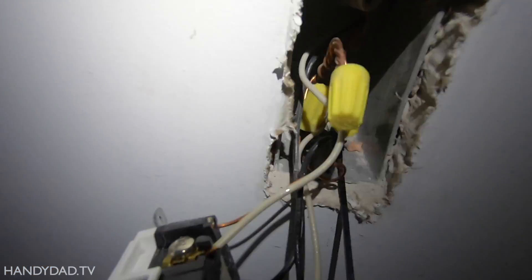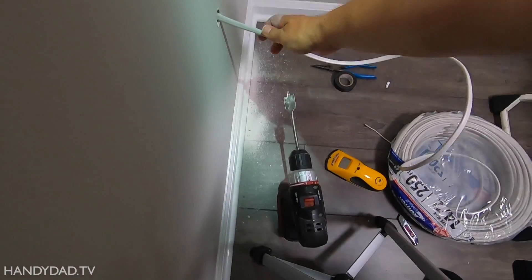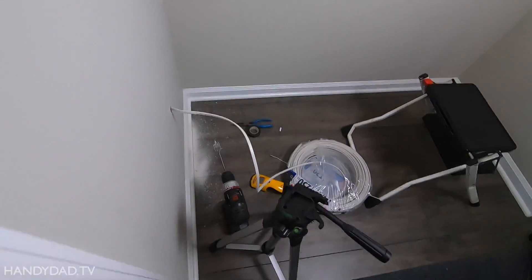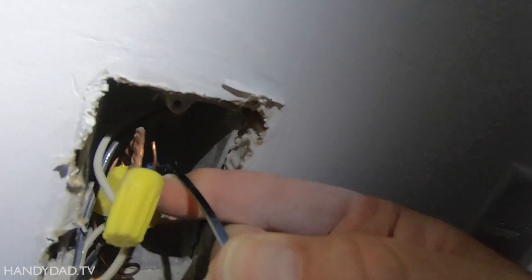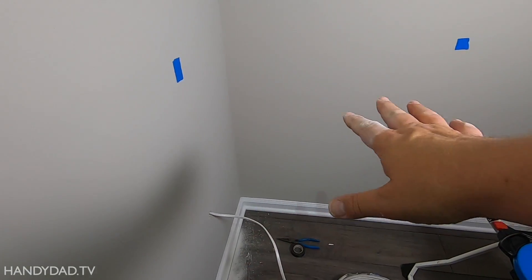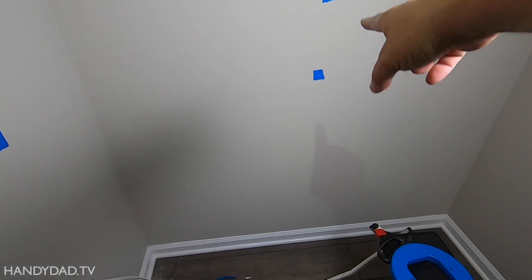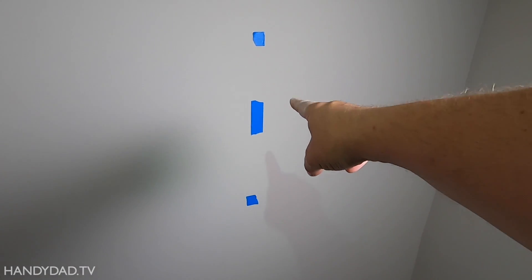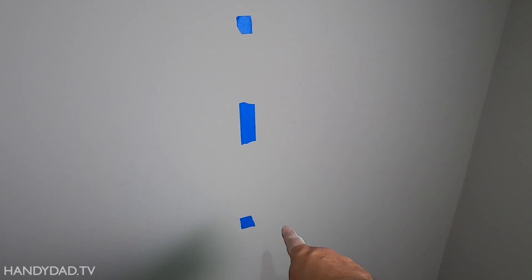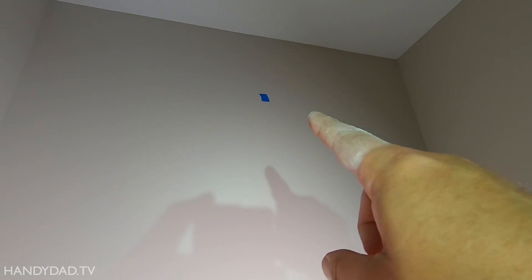I'm at the wire. I just got to get it out. Plenty of slack here. Now I've got my power feed coming in. Remember, there's going to be base cabinets here that are going to hide this wire. I'm going to bring it around the wall, then put another hole here and bring it up to about there — that's where I'm going to put the other outlet. This is the top of the countertop. That's the bottom of the cabinets up top. And then I'm going to run another one all the way up top there.